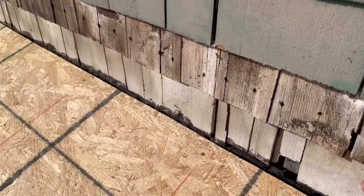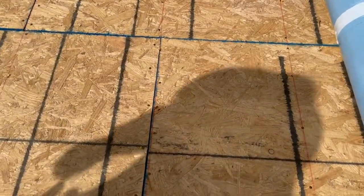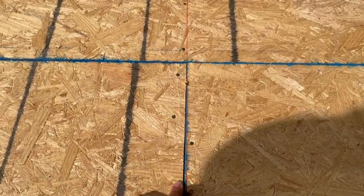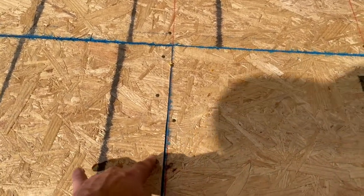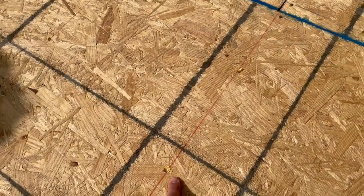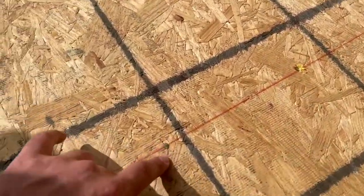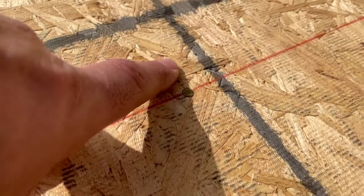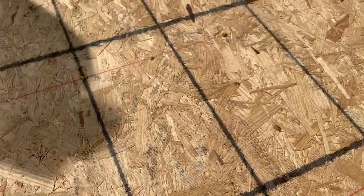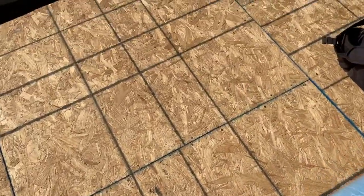The nice thing is that we have positive drainage and a decent slope here, so we're going to be roofing up and into this siding, which is easy to do with a self-adhered. You can see our nailing patterns here — we're going every six inches on center at the seams, and you want to stagger them. Then on the field, you want to do every 12 inches on center. You want to snap chalk lines there. You can see that red line is a chalk line we've drawn out in order to properly hit our nails on those rafters.